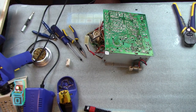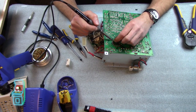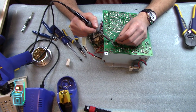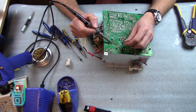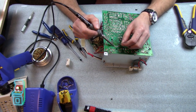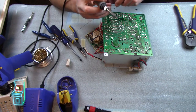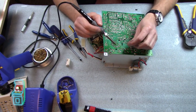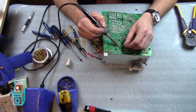And now I'm going to get some solder. Let me know in the comments — what do you guys set your soldering station to? Mine's set to 750 right now, but I used to set it to 650 for the longest time. But people are saying it's better to do it hotter because then you get in there quickly and you can get out quickly too, and the pads won't lift on you. I think age really is what determines it — I've soldered some Williams power supplies like on my Defender, and those pads fall off for nothing. It's just the age.